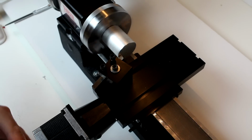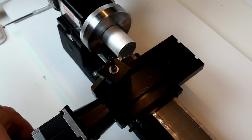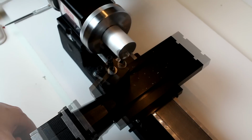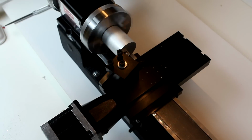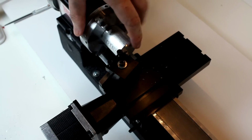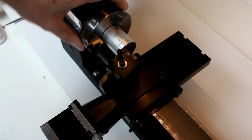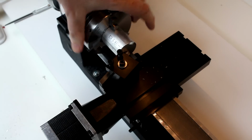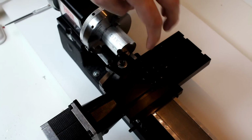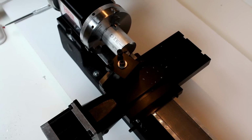We have to be extra careful on interrupted cuts because they can damage the cutter and they can cause some other issues. So I've backed the Z-axis off again, and you can start to see where we've got a smoother section depending on how the light picks that up versus the rougher section. Just on that one little segment, but we'll keep going and doing the same thing.